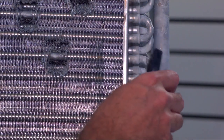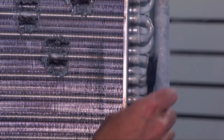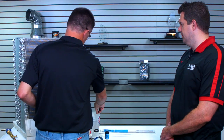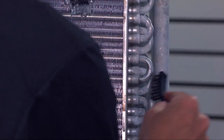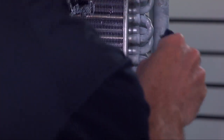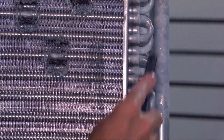Now it is still going to be quite warm — so we should hear just a slight hiss of the water right there, which tells us it's still a little bit warm. We're going to brush that off, clean it off to get all the flux and everything off the outside of it. That flux, if left on there, can be slightly corrosive to the aluminum, so you need to clean that well. Just use a little bit of water on the stainless brush that's included with the kit.